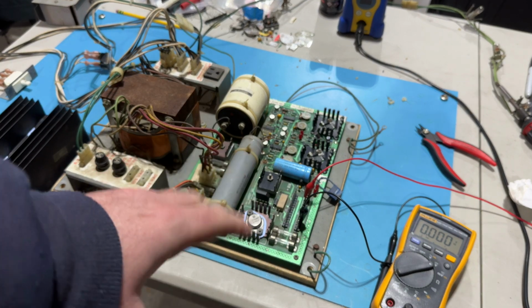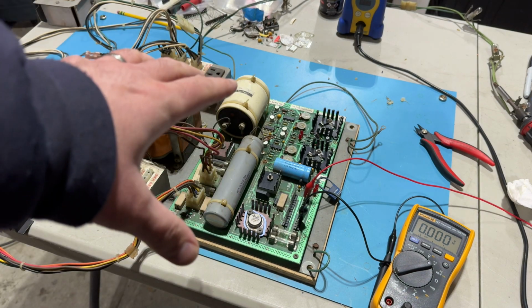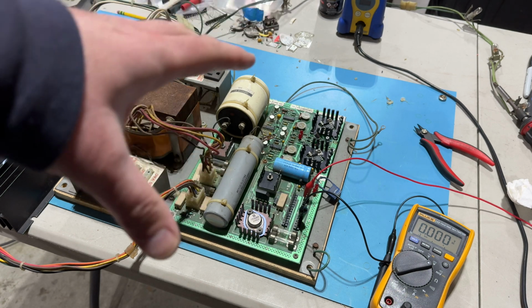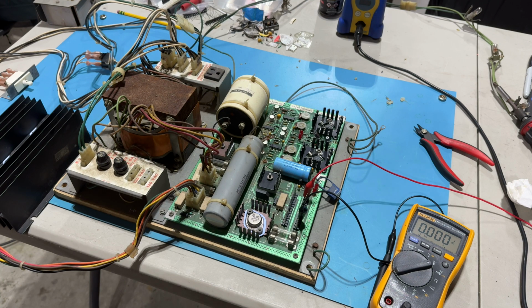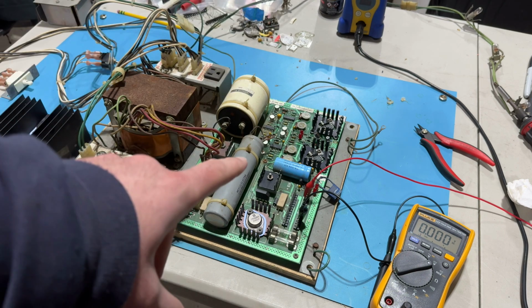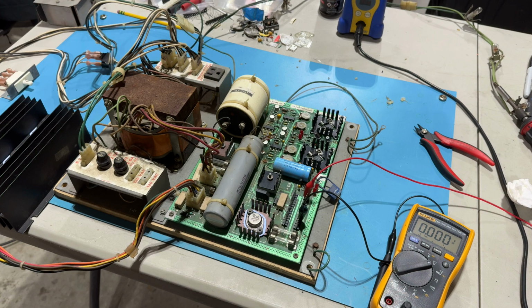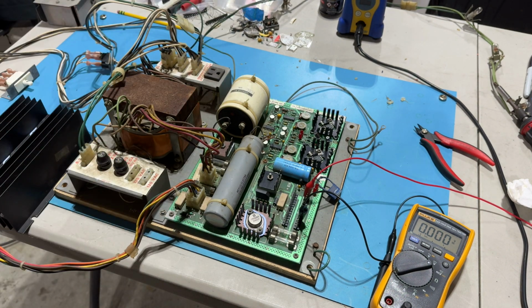So I spent some time with the manual and reading old threads, and there's a couple of things I want to try. The first thing I did was address the pots. There are these 4 pots here to set the voltage and the current limit for the +5 and +12, which is really what the board uses. So I cut off the hot glue that the factory used to hold them in place, to break the pots free.